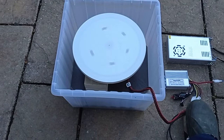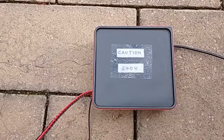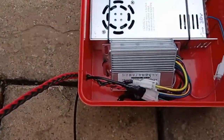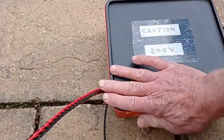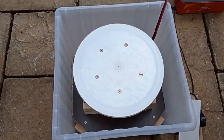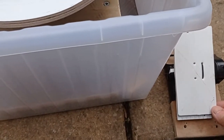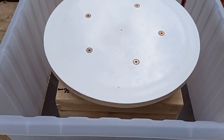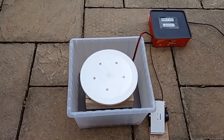The electrics here are exposed for ease of seeing what's happening, but they go inside a waterproof box just tied in with cable ties, and the bunch of unused wires that I bound up with black tape contains a multi-connector for the 3-speed function. So if you want to reduce the maximum speed, you can just short out 2 pins on that 3-pin multi-connector. So here's just a quick demo. Finally, you can set it by hand to whatever speed you want and it holds, and obviously use the foot pedal.